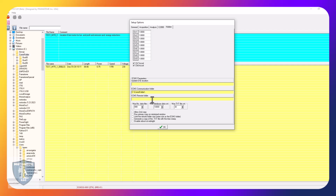So you have to have flooding protection in place, especially if you're using a Cisco switch or something like that. Especially certain Cisco switches, you need to make sure that you turn on flood protection. Otherwise, you can overwhelm that switch. So that's part of the reason why we have that in between, because otherwise there'd have to be a brain in the box, and there isn't. That box is a multiplexer and a few other components. So that's all set.